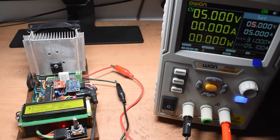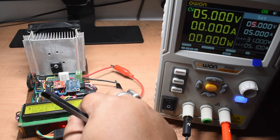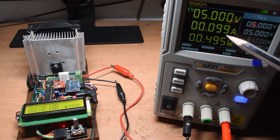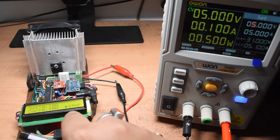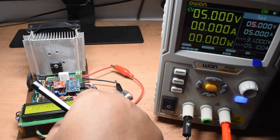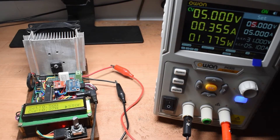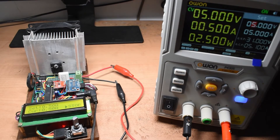Now I test the current mode. I select current mode and set it to 100 milliamps — the lowest value in the code — then hit start. The current increases and holds at 99 to 101 milliamps, giving around 1% error — I am happy with that. Then I test at 500 milliamps and get readings of 500 to 503 milliamps, which is far more accurate than I expected.